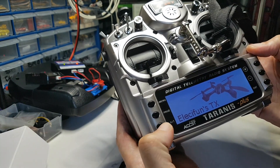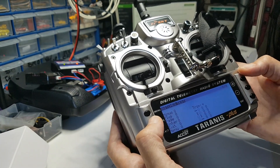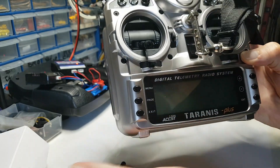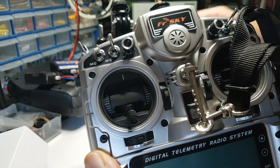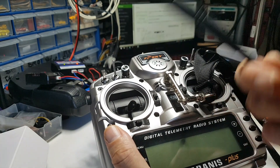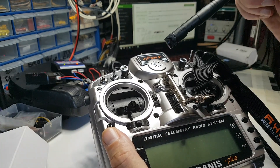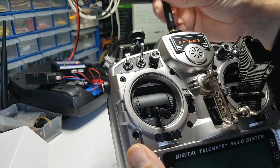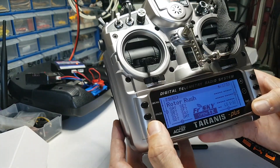I'll put it on and turn it back on again. Welcome to OpenTX. I'll skip past that, hold down the menu, jump to page — and look at that: 43, 46, 37, 4. It's not happy. So I'm going to turn that off. That's telling me that the VSWR is going high. The return voltage back through the antenna into the system is enough to kill the transmitter.